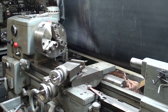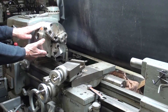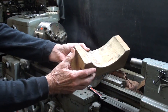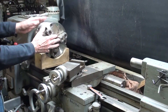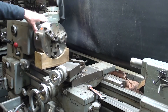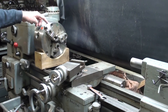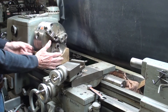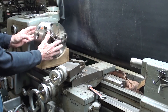Okay, what's this video really all about? It's about removing this 48-pound chuck — it's a finger pincher, it's just hard for me to handle. What I have done in the past is I made this cradle, or saddle, years ago, and that fits right under there, allowing me to slide it off the spindle. Remember, this is a taper key — sometimes called a long taper — spindle. It is not a threaded one. In order to use the crane, I really need to loosen the chuck, get it on the saddle, and then it can easily be lifted. It's all about alignment of the chuck with the spindle.